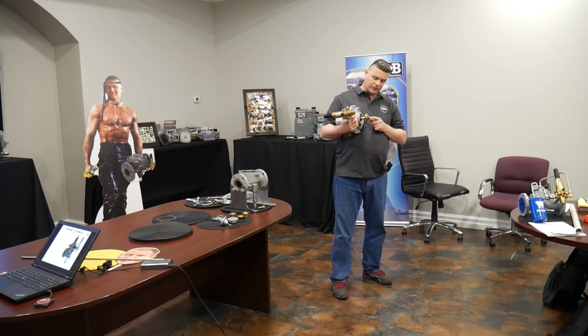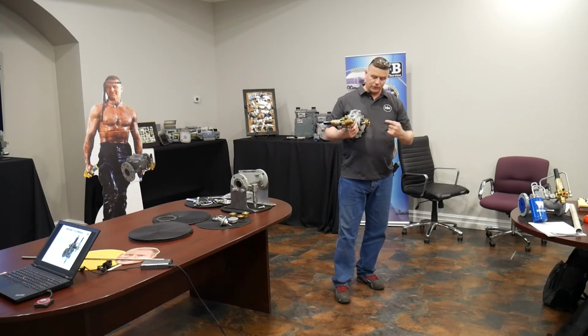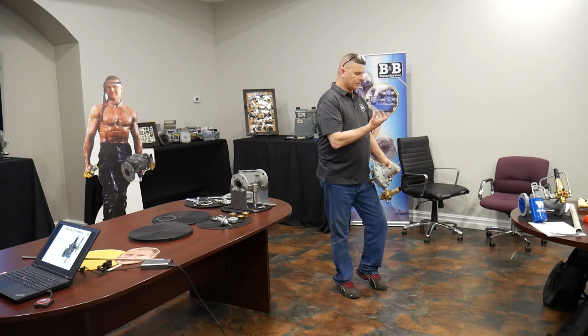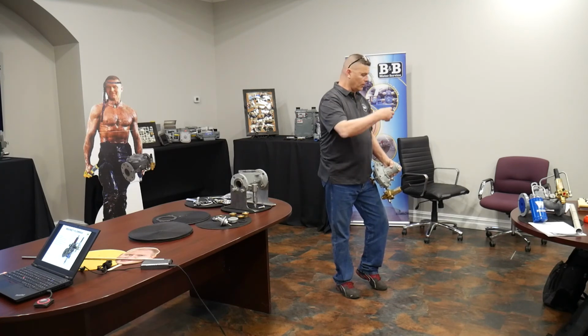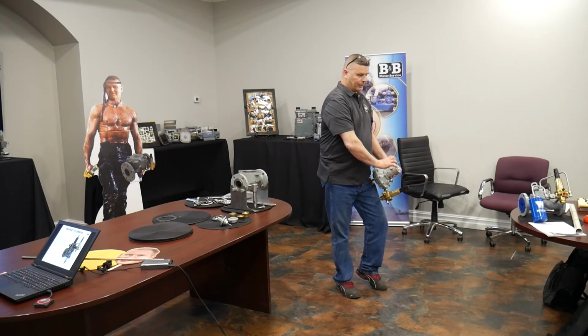What he's talking about is, this is hollow on a standard Flowmax. So while this thing is waiting to lift, it's also basically putting gas at inlet pressure up into this top chamber, so it sits on top of a piston. It's the exact same surface area as the orifice itself. So downward pressure with that gas, aided by a little mainspring to give closing bias.